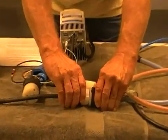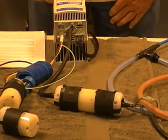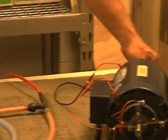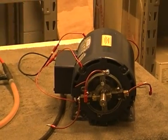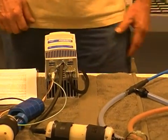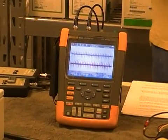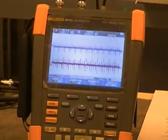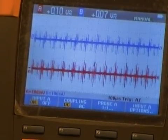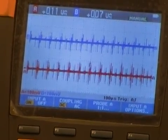I'm going to reconnect. This is the frequency drive. Now we are going to power our motor. We have no brush grounding systems hooked up. Both of our bearings are reading to ground just like a standard motor would be out in the field. I am now going to start the motor up — it will come up to speed. This is a frequency drive driving an electric motor with no Coolblue cores. As you can see from the screen, there is a lot of current spikes — high frequency current on both the common mode leads and on the ground wire.